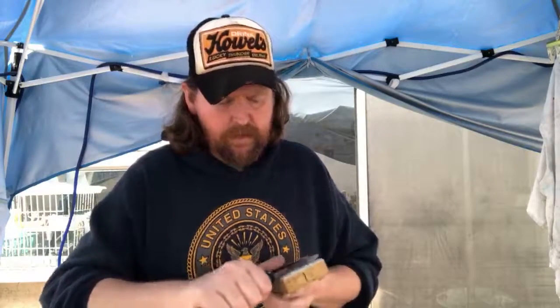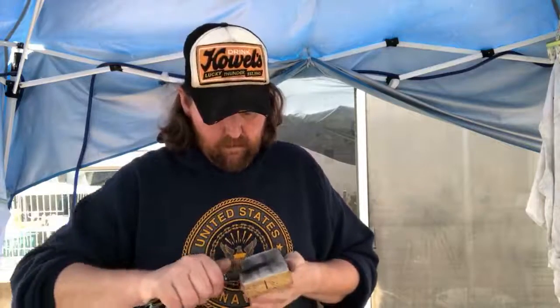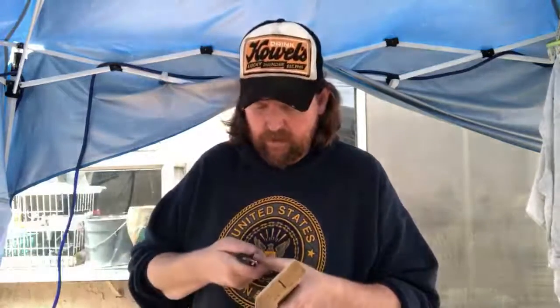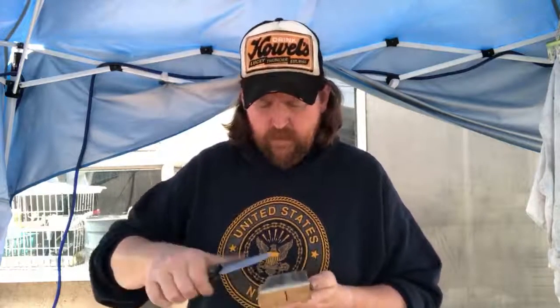So you can do that with this. And the nice thing about this is it's super fine and it just polishes it off, as opposed to going back down on a fine stone and then having to go back up. That's what these are really good for. And that's why I use diamond, because it continues to cut. It's not going to burnish off the edge. It's not going to detract from how it cuts, but it allows you to refine that edge, polish, and take off those shoulders gently.